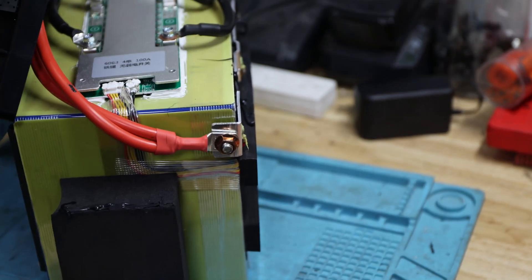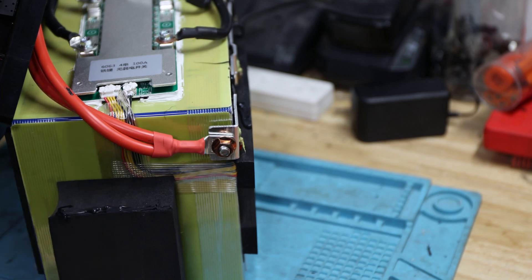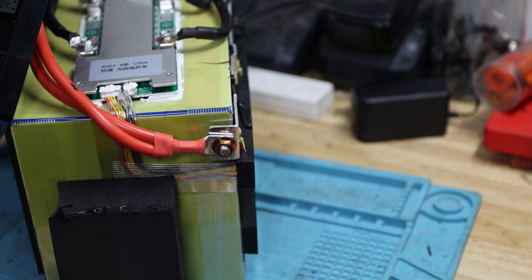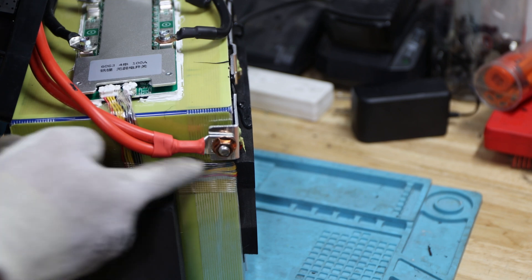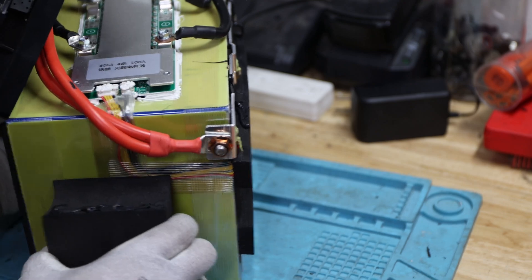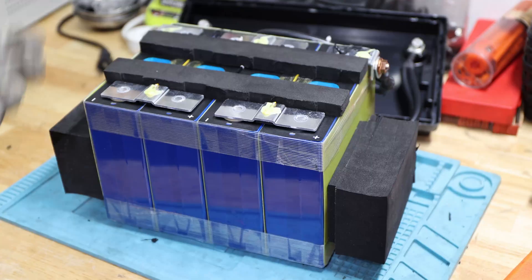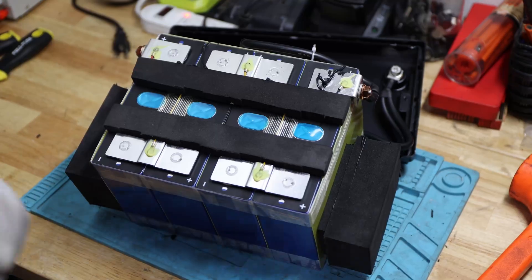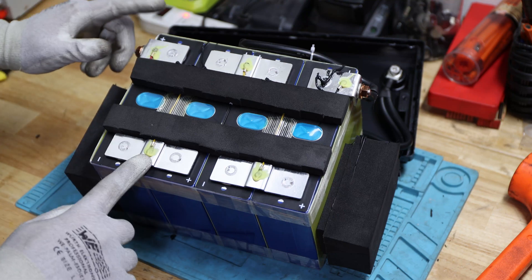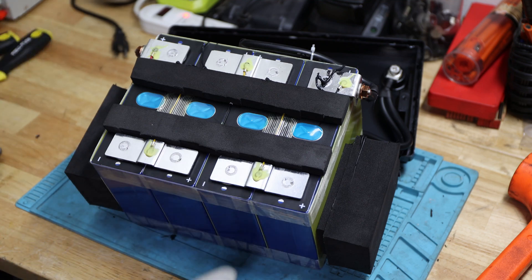The temperature sensor is routed below in a nice black, gold, and red wire — the flag colors of Germany, just want to highlight that. It's routed nicely but just secured with packing tape, as we often see. Looking at the cells themselves, all the vents have room to breathe. On the bus bars there's a hump in the middle, which is good for contraction and expansion — likely laser welded.